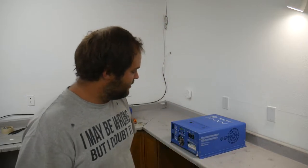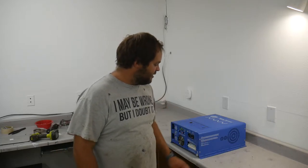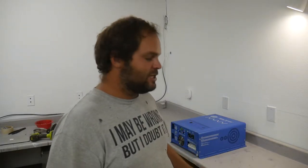But anyway, on to what this video is about. So I bought a great big expensive power inverter, and I'd like to make this video all about these power inverters. I'd like to talk about the different kinds. A lot of times the similarities in the names don't mean they work the same. This one is called a low frequency inverter. We're going to take it apart and see why it's called that. Low frequency pure sine inverter specifically. There's high frequency pure sine inverters, modified sine wave inverters, and we're going to talk about even modified sine wave converters, why they're not all created equal. There are definitely places for all of them.